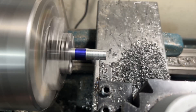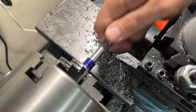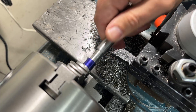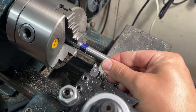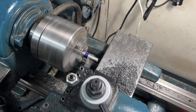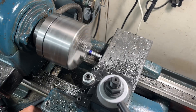Up until this point I've been very careful to machine these parts as close to my design as possible. Now however I'm machining more for a desired look and not to the design dimensions. When I think the stem is getting close to the final size, I reach for the cap instead of reaching for my calipers. Checking the fit, I'm getting close to the necessary dimension. After a final skim pass I once again check the fit with the cap — the gap is 50 thousandths of an inch wide, which is exactly what I wanted. But I'll be honest — this took quite a bit of work to get the fit right. I overshot the fit multiple times and kept having to move the taper down the bar until finally I nailed it and shortened the stem to the correct length.